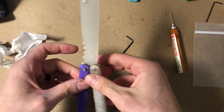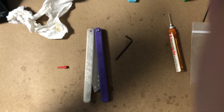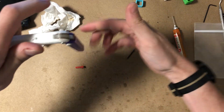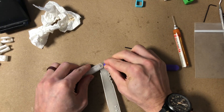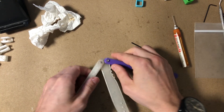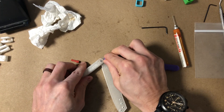Now we're going to tune it. The handle swing is pretty stiff on both sides, so we'll tune it just like we would tune any other washer balisong. Starting with the bite handle — you can see it's very stiff — we'll just incrementally back off the pivot screw a little bit at a time, about an eighth of a turn. After each adjustment, press the hex nut firmly into the handle to make sure it's seated, then retest. Repeat this process until you're happy with the handle swing.